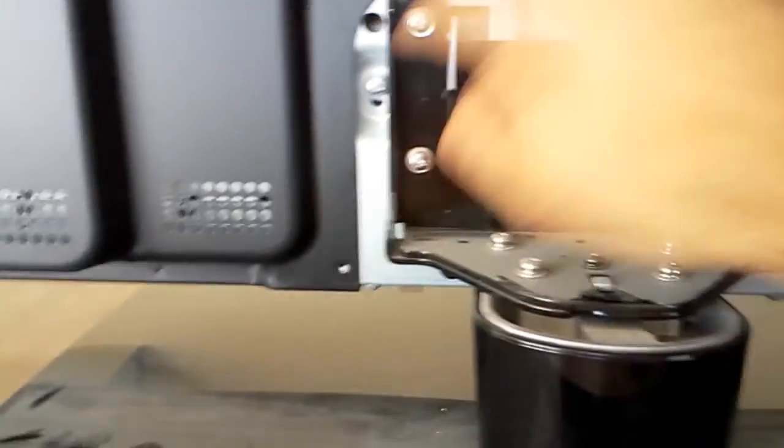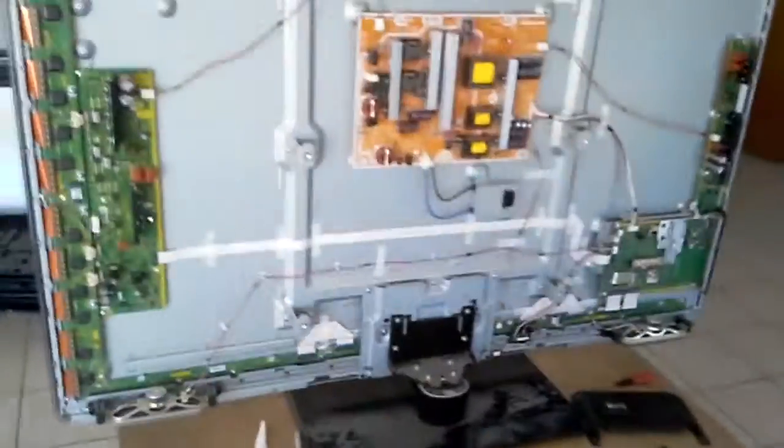Take all these back together — everything screw-wise you've got to remove. There's a cover that stays here. In order to pull the back panel off: screws here, screws here, screws all around this area — everything you can remove. The important thing is do not remove those four screws because they hold the stand piece together. When you've done that, you can actually remove the back panel because nothing holds it, and you get access to the TV interior.